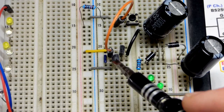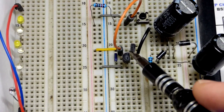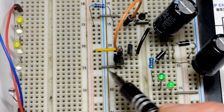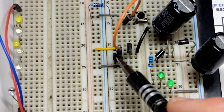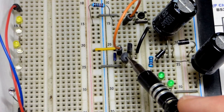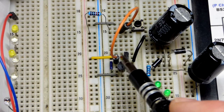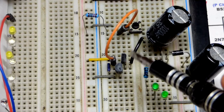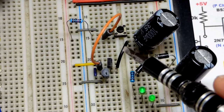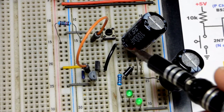Now we look at the transistors of the actual circuit — that's a voltage doubler. Here's the charge pump capacitor. We have an N-channel enhancement mode MOSFET. Both gates are tied together. When you get a high input, that turns the N-channel on, connecting to ground pretty much directly and allowing the capacitor to charge, because the other side of the capacitor is at the positive supply. Once it's charged, we turn on the P-channel enhancement mode MOSFET by giving a low input, which also turns the N-channel off. It then connects directly to the positive supply. There's other circuitry on the other side of the charge pump capacitor headed to ground, so giving it a positive over here makes their voltages add up to push current. As the capacitor pushes current, its voltage goes down, so you have to keep repeating the cycle.